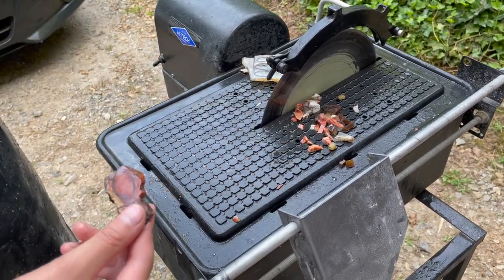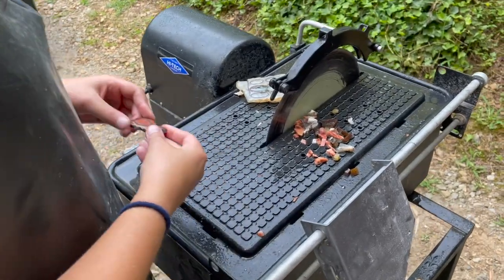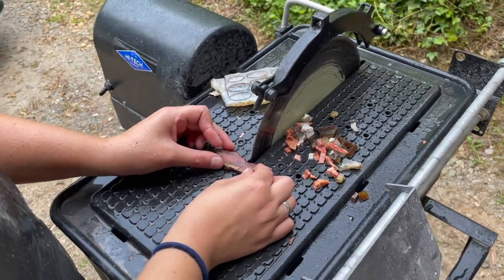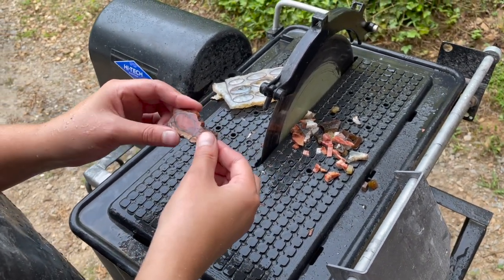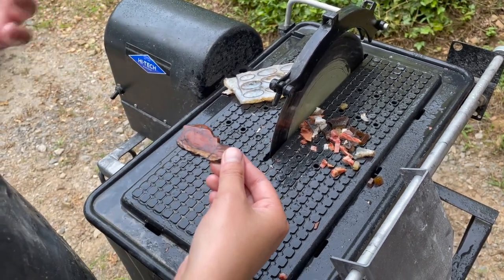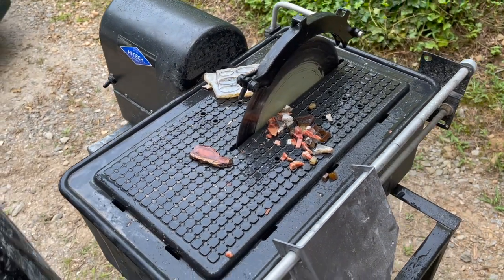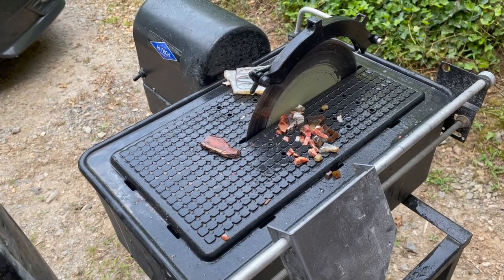The only thing you want to do is wear eye protection and ear protection. If you do not want to take a bath, wear the apron. So what you're going to do is turn your saw on and just follow your lines and see what happens. Occasionally you go to cut a rock and it falls all to pieces. It fractures. If that's the case, then you start over, try again, or just go with a different shape. But that is okay. It should not take long at all to do this one. I'll put my safety glasses on. Earphones.